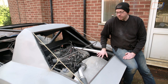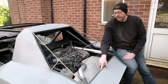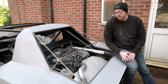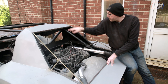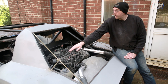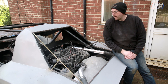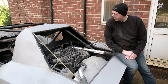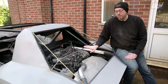It's also going to need some bracing across this section just to hold the panel where it's going to try and flap around a lot, so it'll have bracing roughly a third of the way in from each side up to the midpoint and across to this section. We can bond the aluminium to those to stop it flapping, which would be really good. The smaller panel up here will probably need something too, but I'll wait until we've got the window view sorted and then put something down across the inside edge, leaving as much space as possible to look through without obscuring it. For the time being this frame is done, and what's even better is it's really nice and strong.